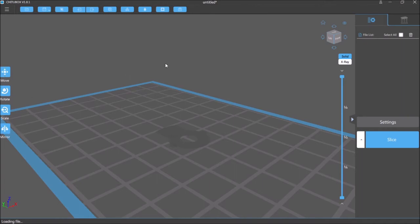I don't need to modify the position on this. I might be able to work with what's here. We need to add supports. And the supports, as you see as I try to do this, will give it some additional plastic to add some rigidity. The distance between, say, this point and this point isn't a whole lot, so there will be enough plastic material in supports to keep this rigid.